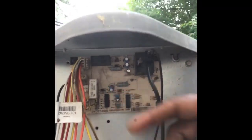This lead here is the defrost thermostat. What's happening is this defrost thermostat is actually going into defrost, causing the system to reverse the valve and go into emergency heat in the middle of the day. I have never seen anything like this before. The only way to really find out what's going on is to disconnect the defrost thermostat from the defrost board.